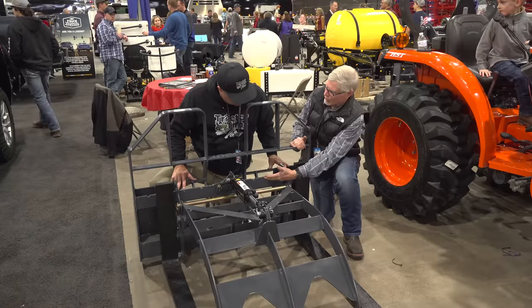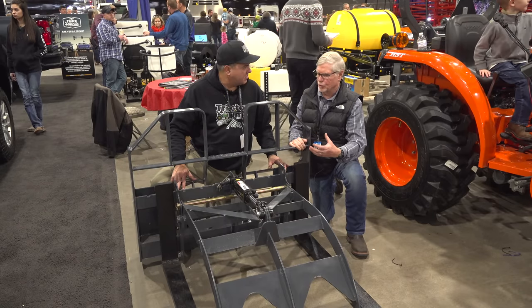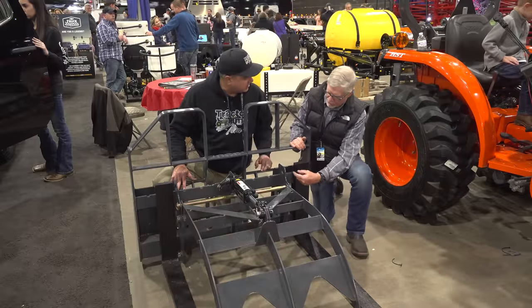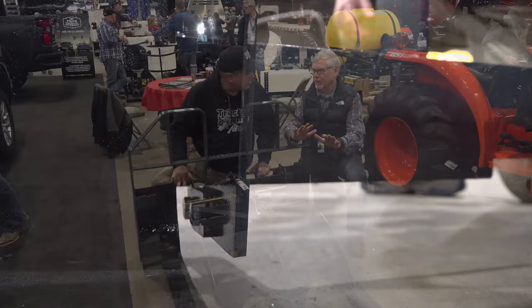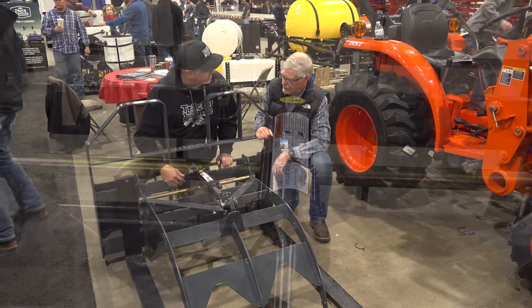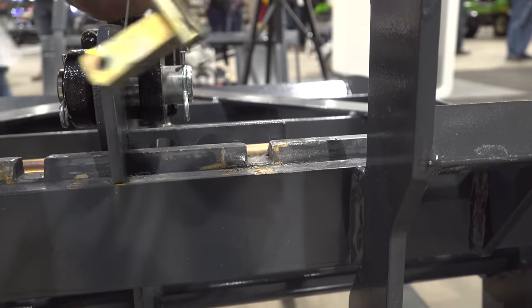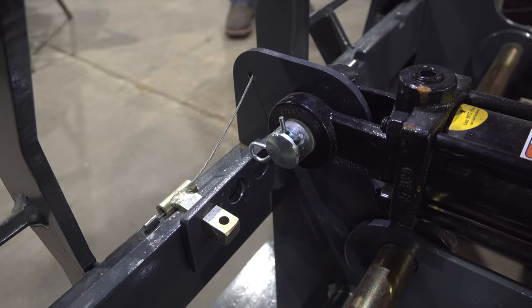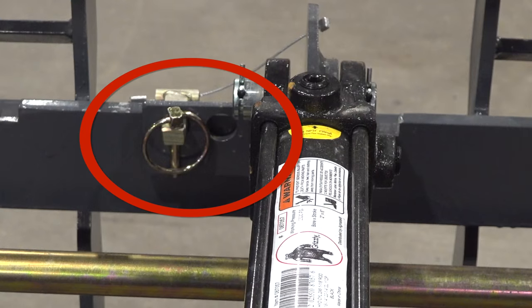This mounts right on the rail of the pallet forks. This is what they call a Class 2A — I believe it's 16 inches from the bottom to the top. They're all standard forks until you get into the industrial style of forks. On the top, we hook into the rail with a hook, and on the bottom we also hook to keep it from swinging up. We use a bolting system to keep it secure. And for left and right movement, we came up with a device to keep it from sliding left and right. The length from top to bottom is standard, but the slots are not standard — you can have thin slots or wide slots, spaced four inches or one inch. So you've got three different holes here to hopefully catch one of the slots.